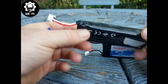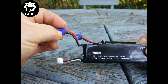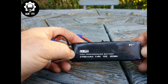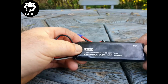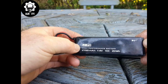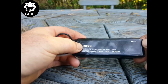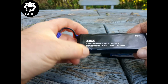Your battery has a voltage regulator in it. What the voltage regulator does is, if it senses a high amperage draw, it goes into protection mode which shuts the battery down. A lot of people might think that's a good safety feature — you don't burn out your ESCs or motors — but it can cost you your quadcopter. If you're flying with stock batteries and using aggressive propellers, carrying a gimbal, or flying in manual or altitude hold mode, and the protection becomes active, your drone is going to fall from the sky. Where it lands you're probably not going to be able to find it, because your coordinates aren't going to be exactly where it's at — when the battery shuts off, the coordinates stop updating.